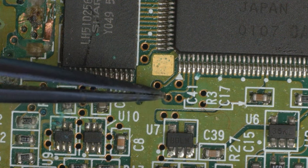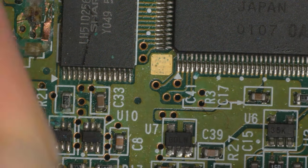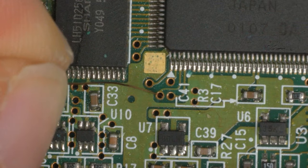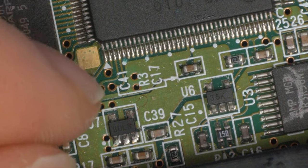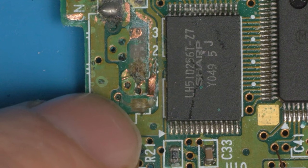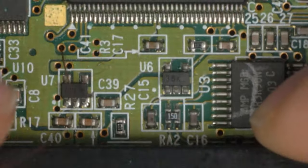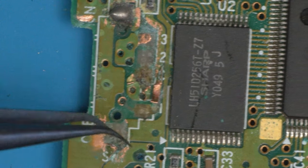If a hole was missing entirely, a little technique: get your enamel wire, place it through the hole, and you can see it comes through the board. The center of the hole is hollow but the inner ring of the hole is still copper, forming a path from top to bottom. If the hole looks very damaged I'd class that hole as non-existent and repair to the other side of the board instead.